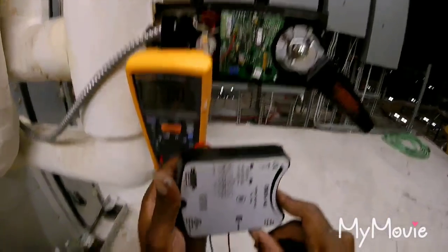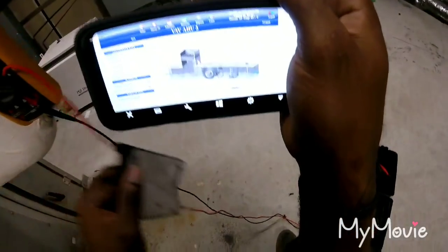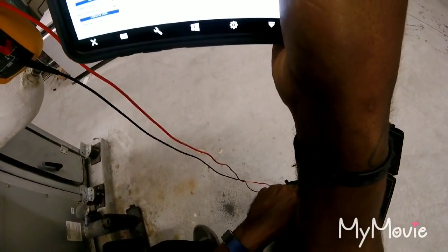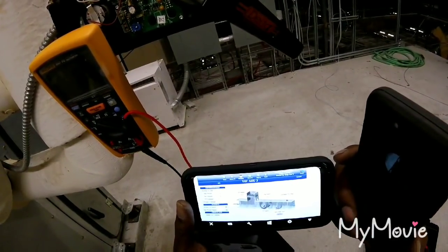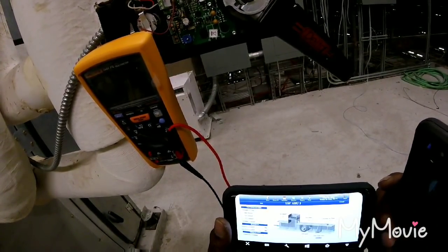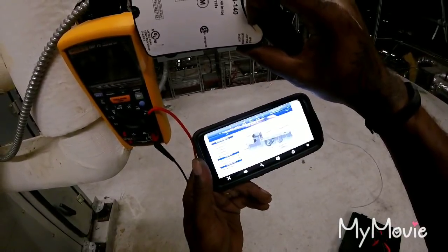Okay, I see now. I think I'm gonna have to change them dip switches. Cause zero on here mean that is, nah, let me see, discharge. What was that discharge air temperature at first? It was 53.8. So it's going up. Now it's at 55. Right. So it did close. Yeah, so that valve closed, but it's going the wrong way.